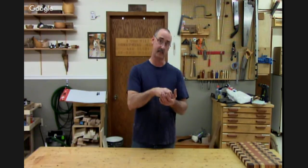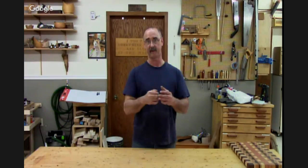Another alternative I like a lot, a friend of mine is a beekeeper, AJ Moses, one of our writers, and he'll give me beeswax. And if you heat up mineral oil, you can melt the beeswax into it in a proportion of about 50-50, and that gives you a thicker mix to apply. Part of the downside of the just pure mineral oil is that it takes a lot of it. When you go with that thicker product, it's actually in this toolbox.